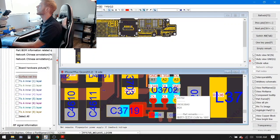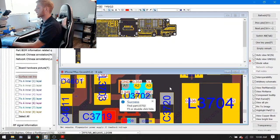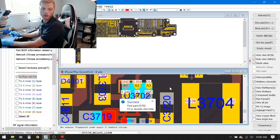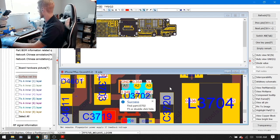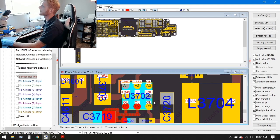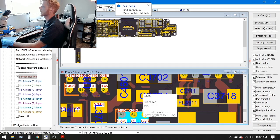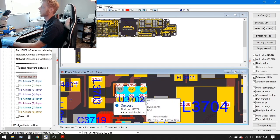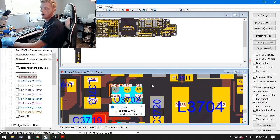And they do. So we will go ahead and take a quick diode measurement on this IC to make sure everything underneath it looks good. It only takes another few minutes to make sure everything is good, because that way if it doesn't work, we don't have to say, oh, now we've got to take the IC back off to confirm that the diode measurements underneath it are okay. So let's go ahead and take those measurements next.